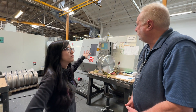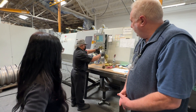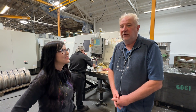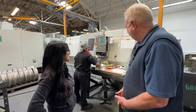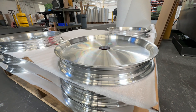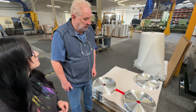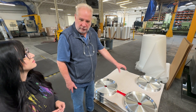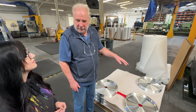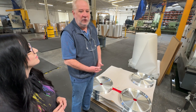So how long does that process take? This process has a cycle time of about seven or eight minutes — that's pretty fast. The operator is wiping down the part, ready to be inspected. We'll show the inspection process in a few minutes, where we do the final inspection on the wheel. What you see on this pallet is turned product ready to be sent to the customer — hardness checked, dimensionally checked, everything good to go. What the customer gets is a part ready to be milled, with their style — whether handles, spokes, or in the case of a motorcycle wheel, the hub — and for a car wheel, the bolt circle drilled and milled in for the fitment pattern.